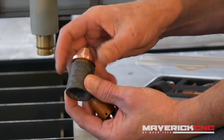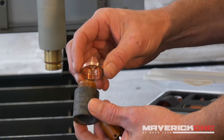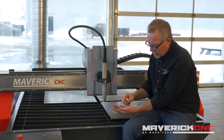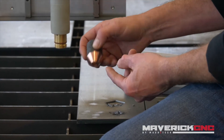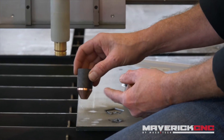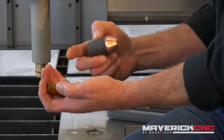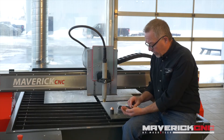The frontmost part — and this is pretty much only on Hypertherm torches — uses what's called a shield assembly. The shield screws onto some plastic threads on the front end of the torch. Those threads are to keep it electrically isolated. This shield's major function is to protect the other parts inside the torch from blowback during piercing. It takes that blowback material and it just bounces off because this is not electrically conductive on the front of the torch. Also, if there's a case where maybe the material pops up from internal stresses and this actually drags on the plate while it's cutting, the shield protects the nozzle from arcing out like other plasma torches do.